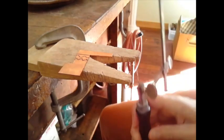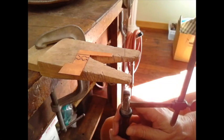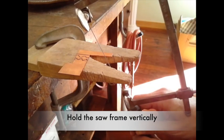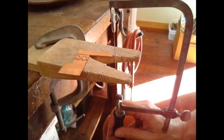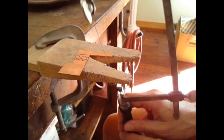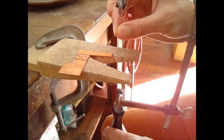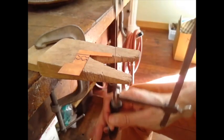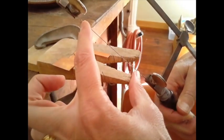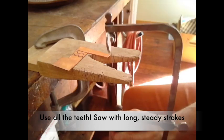When you saw, there are a couple of things specific to jewelry sawing through sheet metal. You always want to hold your saw frame vertically — straight up and down. Don't tilt it on an angle like you're cutting a log. The reason is you'll be cutting through the thinnest portion of the metal. If you angle it, you're going through a thicker section, which is harder on the blade. Also, you have teeth along the full blade length, so use nice long strokes rather than short ones to take advantage of all those teeth.